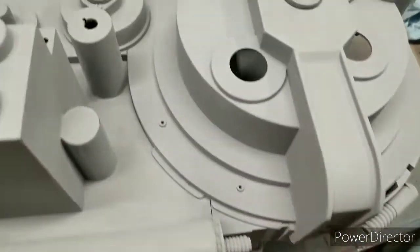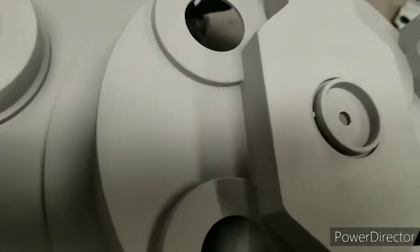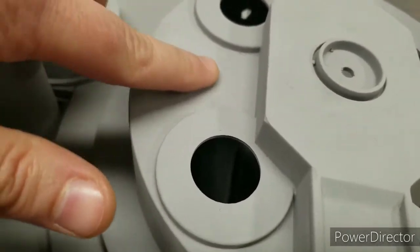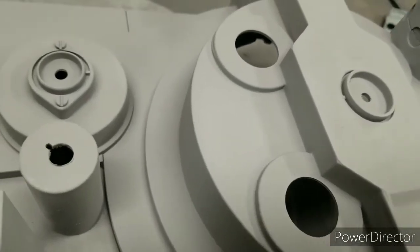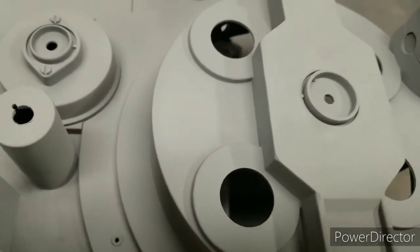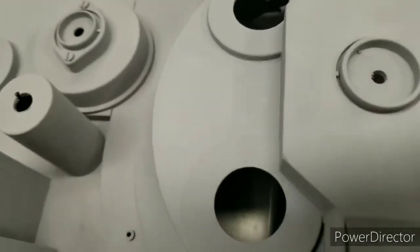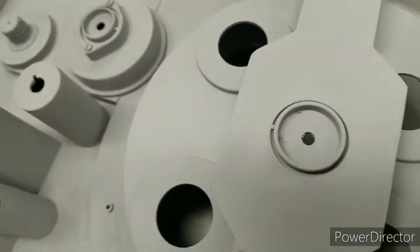So one of the other things I did is I covered up the speaker holes here in the front of the cyclotron, and you can almost just see some of the holes still. So I might go through and sand it over again. You can't really feel them, but you can kind of see it a little bit. The best thing I can suggest to do this is patience. I use Bondo, and I use a filler primer, which I'll be talking about soon. And the best thing to do is really just go slow.